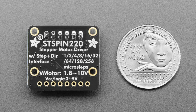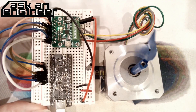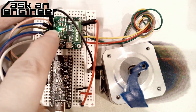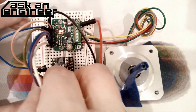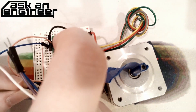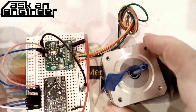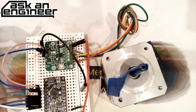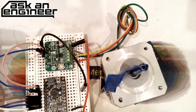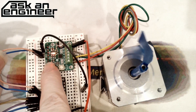Let's go to the overhead for a demo. I just have a little demo running here and it's very quiet - you can't hear it. Believe me, there are a lot of stepper drivers that are very noisy, but it's doing microstepping and just rotating. I do have a bunch of the pins connected - it will work with just the step and direction pins, but it won't microstep at the right rate. By default it's set up to one-eighth microstepping. If you don't want to do any configuration with the pins, that's the default.